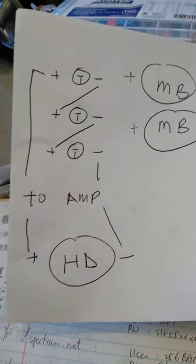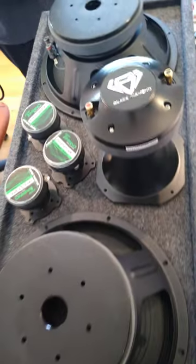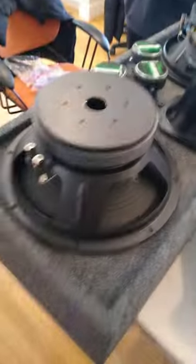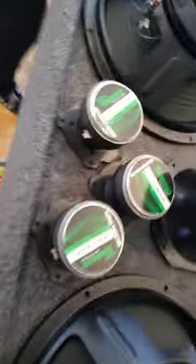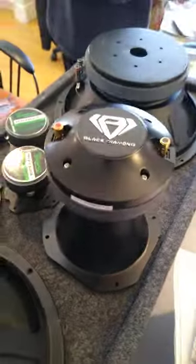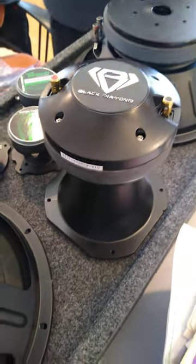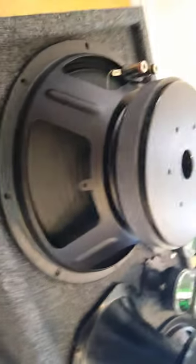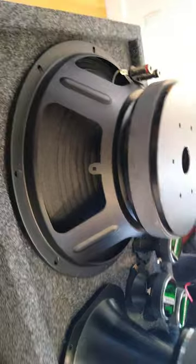That's a combination of series and parallel wiring. The speakers being used today are our own name brand — we call them FNC speakers. We're using three Timpano bullet super tweeters and a two-inch Black Diamond/DS18 horn driver. For the 12-inch speakers, we're using the pro mid-bass speakers — the construction is almost as big as a subwoofer.